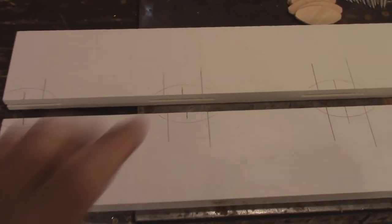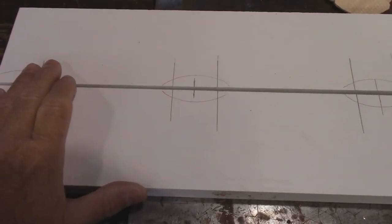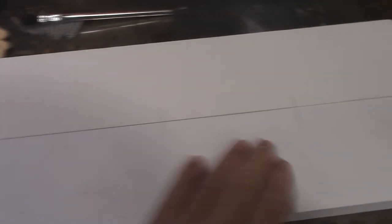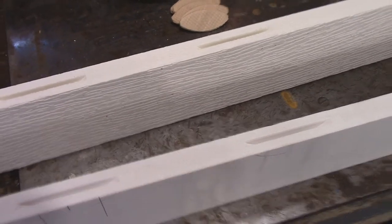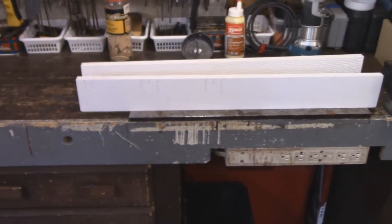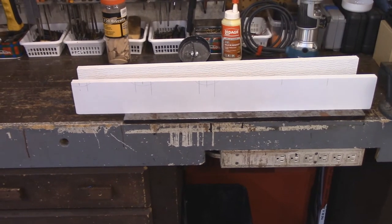Let's see how this all turned out. The whole idea behind using these biscuits is so that when you push your boards together while gluing them, it stays nice and flush all the way along. That's the whole idea — you do this before you glue them up. So this is the idea — just like this — and then we glue it up. I'll bring it back when it's ready to put together and show you what it looks like before you actually put them together.